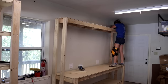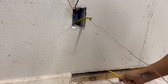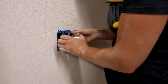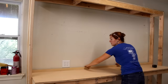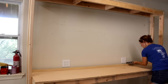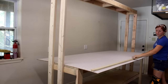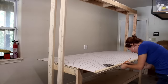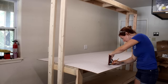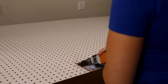Now I started working towards attaching the pegboard in the center. I just released a video showing how I added two outlets to this wall in preparation for this workbench, but now I needed to cut around them. I grabbed an eight-foot scrap — the length between the uprights — set it on the workbench, and marked off the location of the outlets. This is a cheat to avoid a bunch of measuring: I then laid this board on my pegboard and transferred the outlet locations to the face so I knew where to cut. I moved the bench out from the wall to have enough room to work, and used the scrap with my pencil markings to mark off the outlet locations on the pegboard.